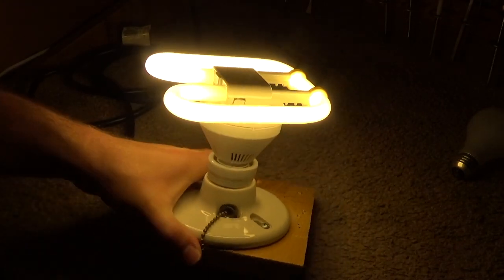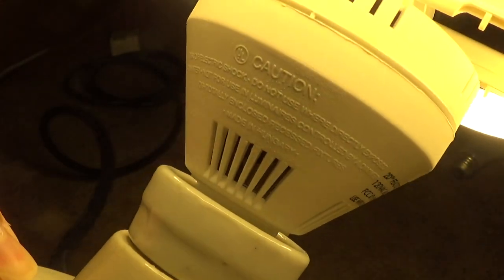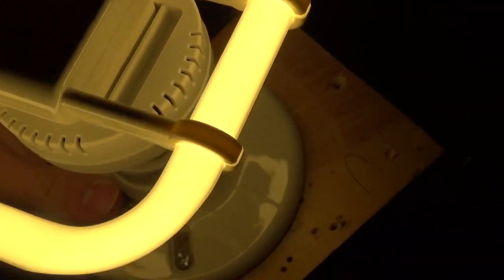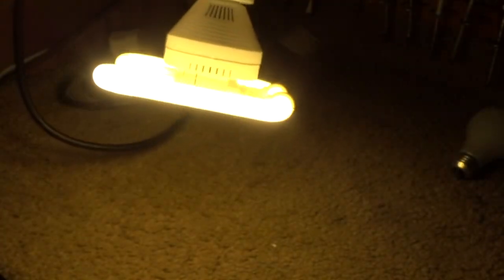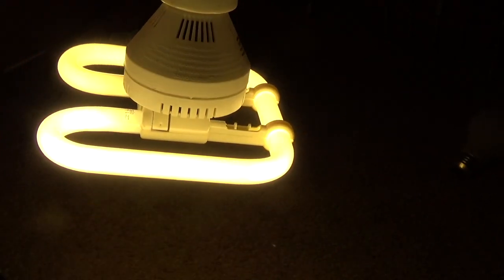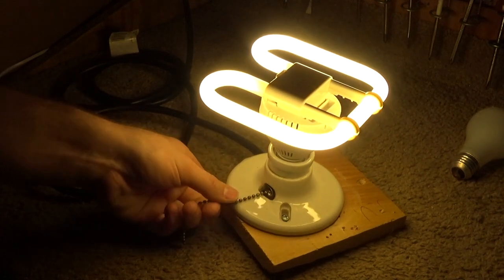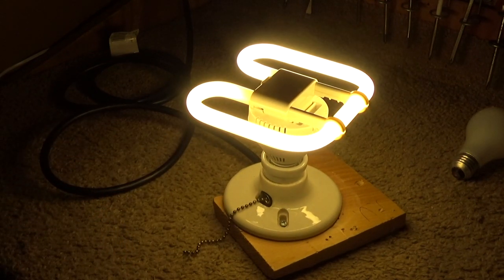Note that the ballast is made correctly because it has vents for heat to escape all over. Even if you were to install it this way, the heat is next to it — not above it — so this would probably fare just fine in a fixture where the ballast mounts up, whereas the traditional CFL doesn't usually fare too well in that kind of scenario.